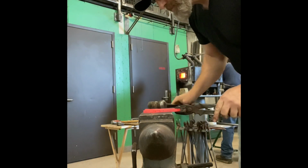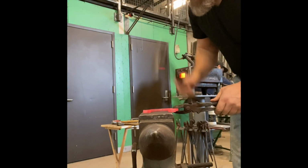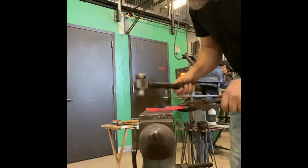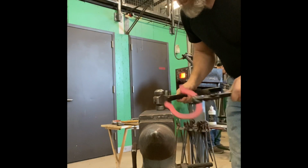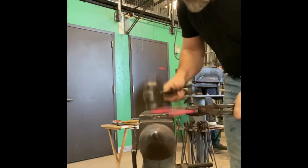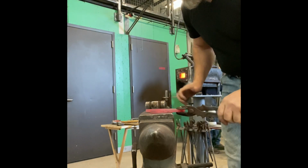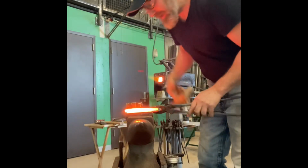So even if you're building an extended heel, the process will be the same as a trailer, and then you'll straighten it back out to be in line with the foot. That'll be your last move. When you do it that way, that's what gives you that inside corner. But you can't do that if you don't have enough of an angle in your trailer. So you can see I'm starting to kind of bring it back around, but I don't have the shape in the shoe yet that I need.